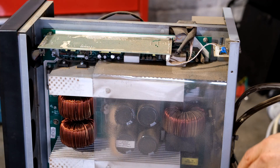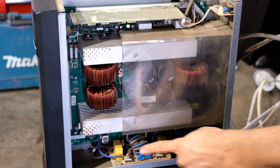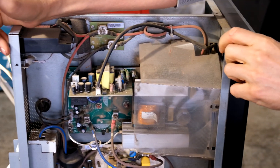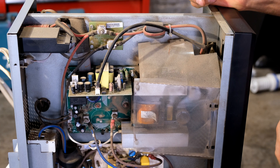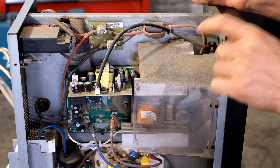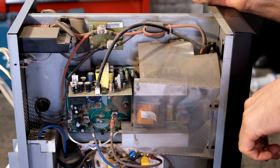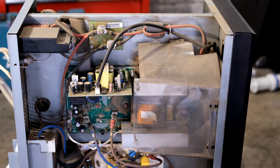If you have a look there's a lot of dust, especially on the roof of the fans and on the bottom as well. I blew this out about six months ago, so this is about six months' worth of dust — you should be blowing this out every six months. The dust eventually causes dielectric breakdown between the components, which is why you must blow this out frequently.